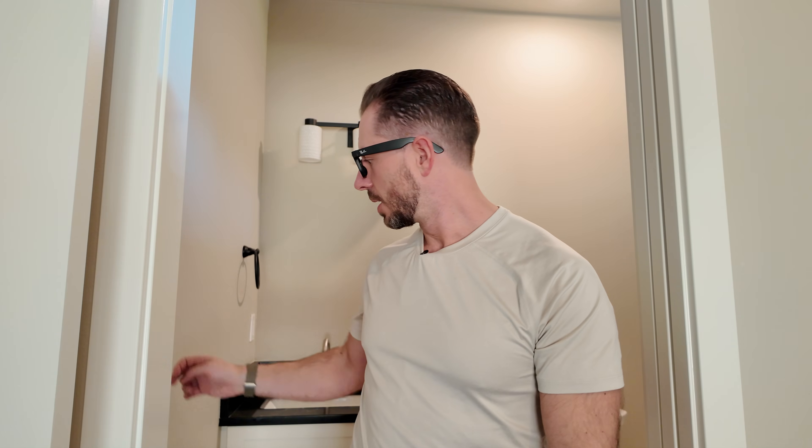Thank you for watching. If you have questions on operability, let me know. As far as wiring is concerned, you do want to have constant hot going to the fan — you could see it was spinning — and then you use the timer module to ramp it down or off as needed. We're also wiring in a switch because sometimes it's not about the shower; it's about the toilet, and you can change the CFM selection for what you want.